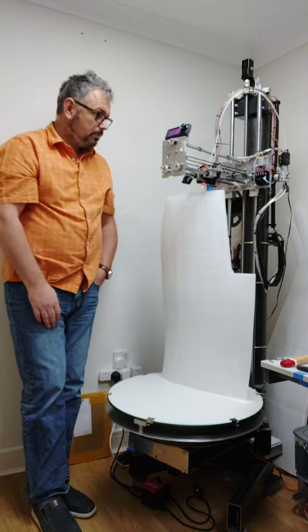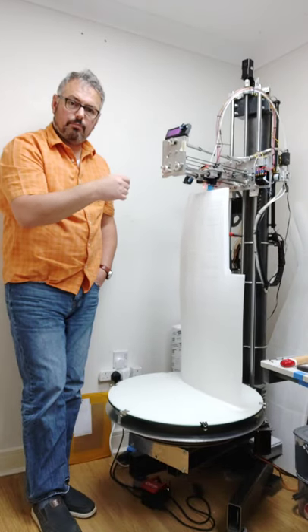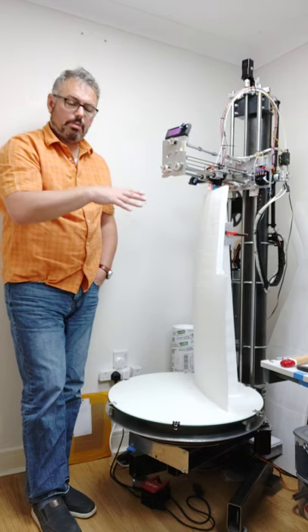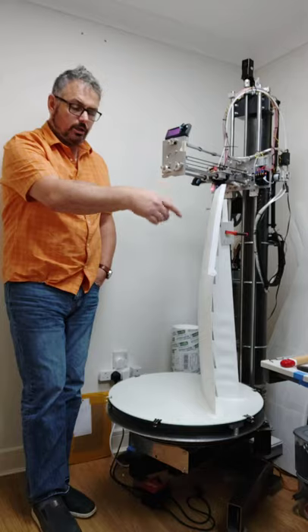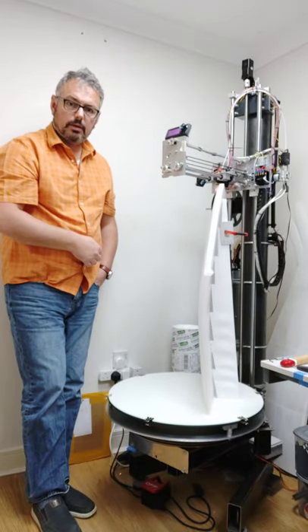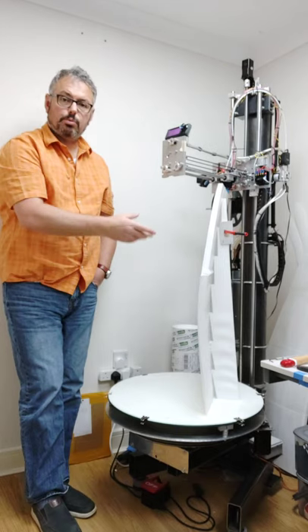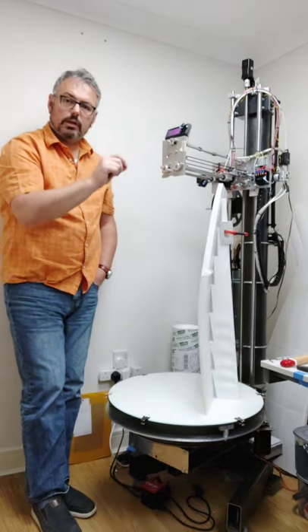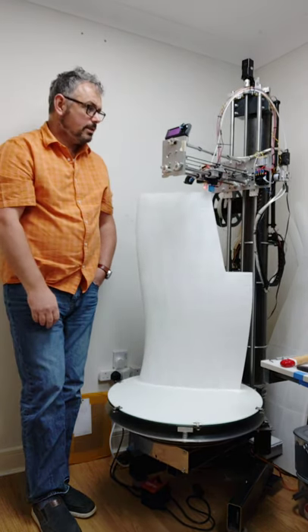The print's going really well. You might have also seen on the back there's a clamp with a weight on the back of the print, and that was to try and add some mass to damp out some of the oscillations. That helped quite a bit, especially on the support I've put on the back there to stop it moving left to right. So that's a printed support that's gone in there, and it's only attached at tiny little points just to make it easy to remove the support later.